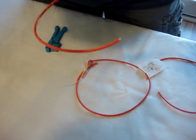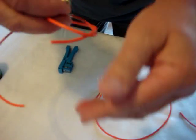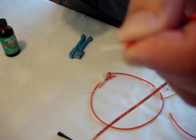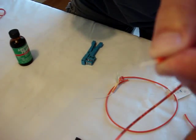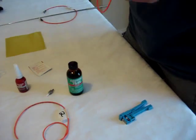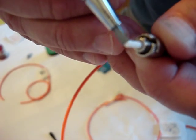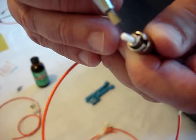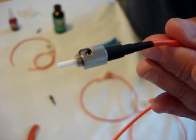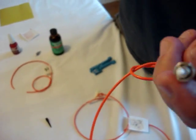How do I know that this is slid all the way back? How much will I see exposed on the end? You want about half of that coming out — about half of that. After gluing, that's how your end is going to look — glued down. But you're going to have some fiber hanging out here, so your fiber is hanging out there.